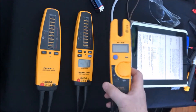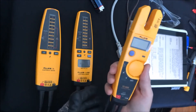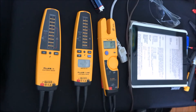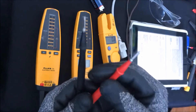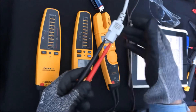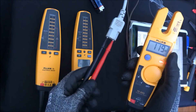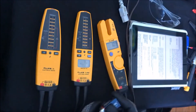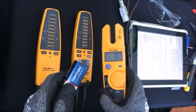The next tester takes this concept further and approaches a clamp meter — this is the Fluke T5, one of the most popular meters out there for electricians because it fits in your pocket and is very easy to use. It has automatic voltage selection, removable test leads, and the category rating for industrial use. It also comes with flat test leads which fit very nicely into outlets and lock in place so they're not always poking around. Here I plug it in, turn it on to voltage, and it automatically tells me I have a hazardous voltage at 119 volts. Because you select the voltage range, if I want to measure a 9-volt battery it will give me a good reading for DC. This is a little bit more versatile than the basic electrical testers.